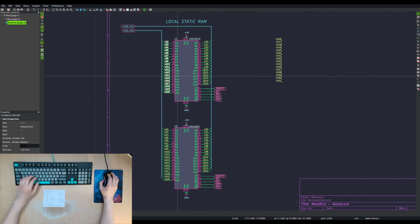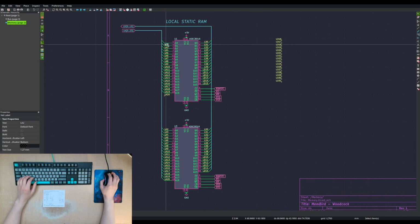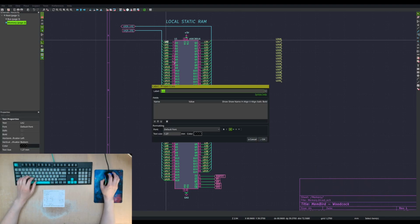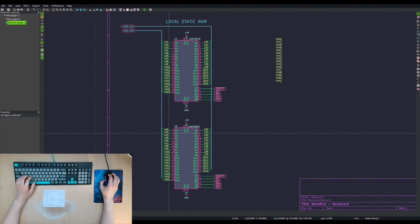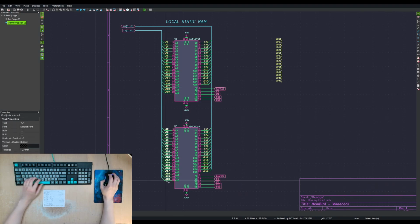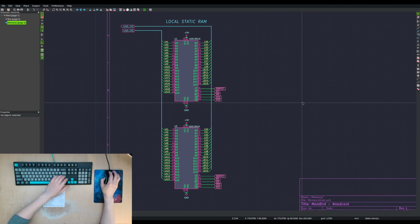So with the other design we had, we were organizing it as two 16-bit chips in a 32-bit pattern. So A2 was addressing a 32-bit chunk instead of a 16-bit chunk. We're going to a 16-bit chunk now, so we actually want the A1 bit here to be our address. So we'll do that for both of these. Get rid of those.